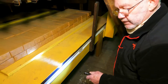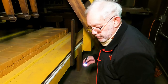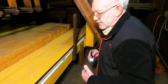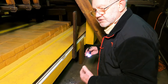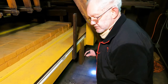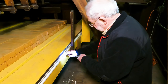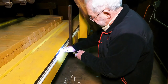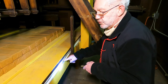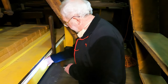We're concerned that when it was rebuilt, they used white glue, which does not soften or dissolve with water, and any residue of white glue left in the wood will not allow hide glue or fish glue to stick to it. We would have to plane off every bit of the wood where the leather and the hinging has to be attached, otherwise it wouldn't stick. So we wanted to make sure that the adhesive used in the rebuild was either hide glue or fish glue. Either one of those, when you re-wet it, gets sticky. White glue does not. And this is definitely sticky.